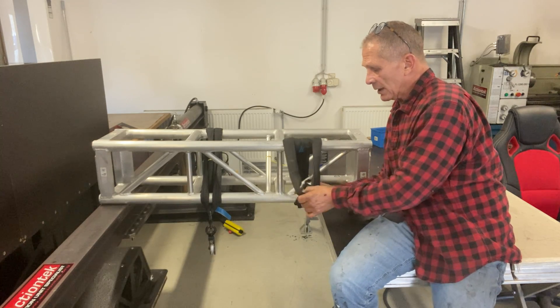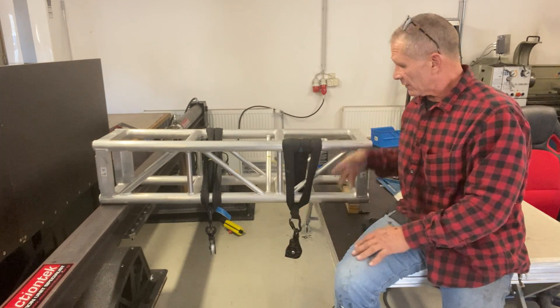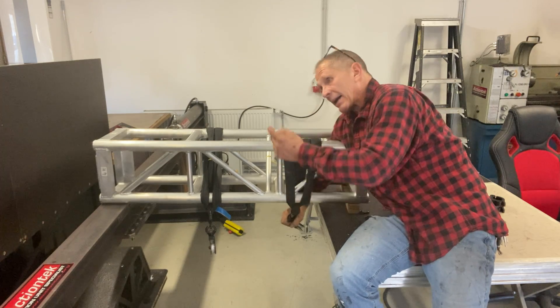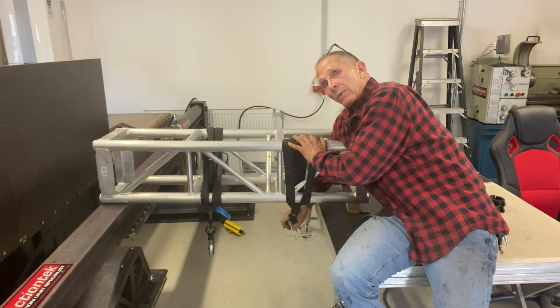Here's your loop. It has to pull back against it in the direction of travel. It should always be back against it when you put load on it. Right now I'm pulling back that way. It's locked directly under the truss and it can't go anywhere.